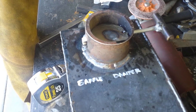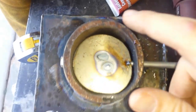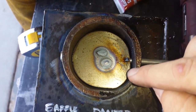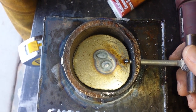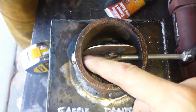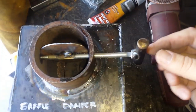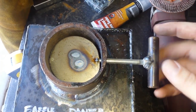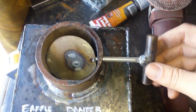I created this damper to continue my testing prototype stove. It's a little loose around the edges, but it's pretty okay. You can see I had to cut it in an odd shape because of the way this drill pipe is worn out. That's the nice thing about CNC — I can tweak it without much effort. I drilled a hole all the way through this pipe, welded a nut to this side, put in this long bolt, and welded a handle to it that is parallel to the actual damper itself, so I know what angle it's at based on however I have it turned.